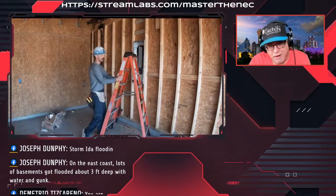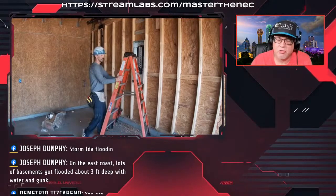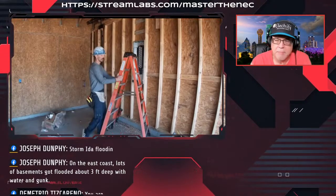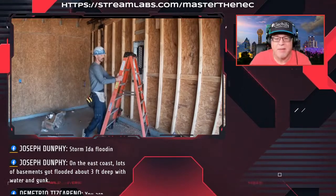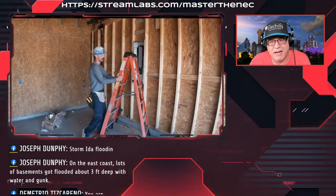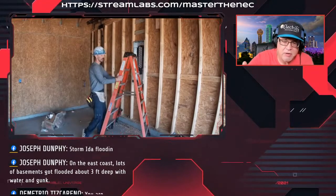So I could have 50 receptacles on a single circuit. Now, you are limited to the rooms like branch circuits, small appliance, minimum of two in a kitchen, and things like that. But in reality, the 3 VA per square foot for a dwelling that we do in a calculation in 220.14 is basically going to cover all those general use receptacles and general use lighting. But it doesn't tell you the maximum number of receptacles you can have on a branch circuit. Now, if you're a commercial guy, you're thinking, whoa, wait a minute, it's 180 VA per strap. I get you, but this isn't commercial. This is residential. So you can use a standard baseline and figure 120 volts, 15 amp circuit, come up with your wattage or VA, and determine how many receptacles theoretically you should have. But as far as the NEC goes, they really don't limit it.